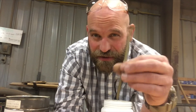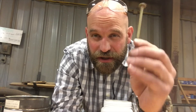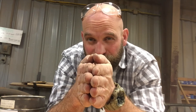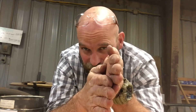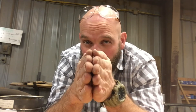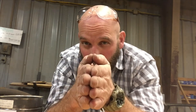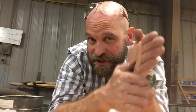Those are my favorite type of screws — I really like the Torx screws. The reason you would want to use a screw over a nail is that screws hold things together tight. Nails hold things for shear strength — a back and forth, shearing type action — whereas a screw is meant to hold things tight together. So if you need something not to shear off, you probably want a nail, but if you want things held tight, you probably want a screw.